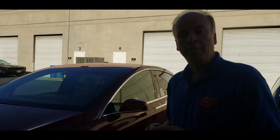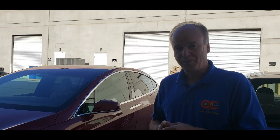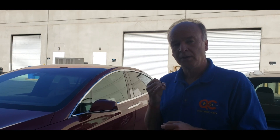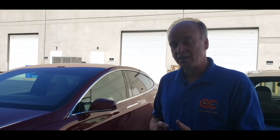Some final words of caution: make sure the extension cable you use — whether from Lowe's, Home Depot, or bought online — is a 10 gauge or 12 gauge at a minimum. I recommend at least 12 gauge. Secondly, make sure whatever portable charge cable you're using is one of the ones we listed. If you use one outside of that list, it's on you to figure out whether it can handle 240 volts — you may actually burn it up. Only use it with known portable charge cables that can handle 240 volts. There are some aftermarket ones that will also work, like Clipper Creek and others, as well as our Jesla Jr. and our GO cable, which also works at 120, 208, or 240 volts. I'm Tony Williams with QC Charge, thanks for watching.